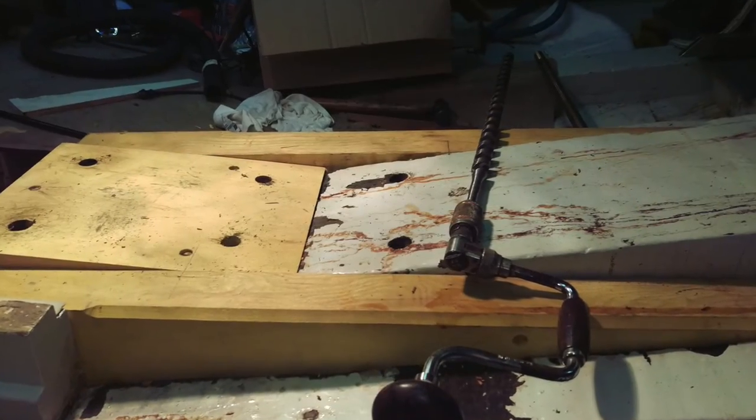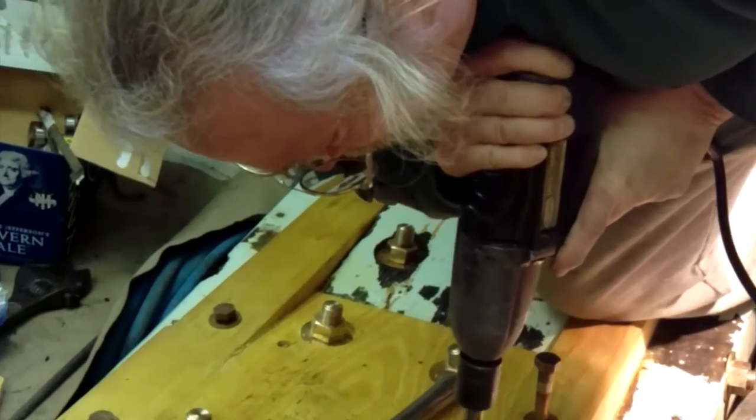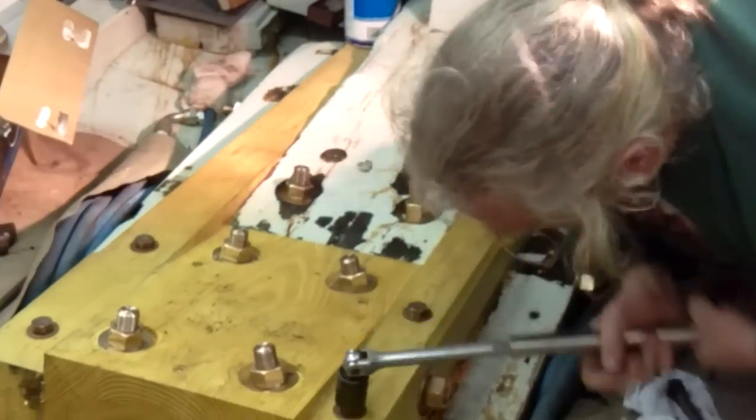The new and old pieces in the shaft log area were re-secured with custom-made bronze bolts to replace the wasted away iron drifts and bolts. Some of these new bolts were welded to plates that neatly fit the deadrise and buttock lines.